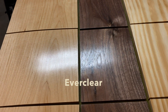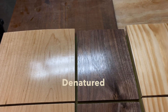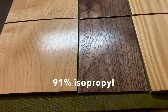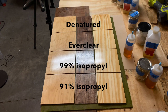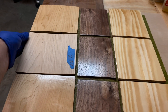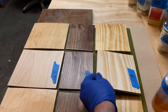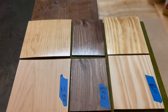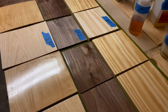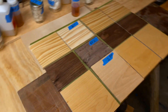I'm very impressed with the 99% isopropyl, mostly because of how little it raises the grain, and it also produces a very nice sheen very early on. I also liked working with the Everclear solution because the smell didn't bother me and I didn't have to worry about using gloves or inhaling fumes. The 91% performed surprisingly well and I would have no qualms using it — it's definitely the cheapest of all the solvents. One thing that is for certain is that I'm probably not going to be using denatured alcohol anymore. My solvent of choice for an upcoming grain-filling project is Everclear since I plan on applying a lot of coats and don't want to deal with harsh chemicals. But I'll try to continue experimenting with these solvents and share any further conclusions in the video description or comments.